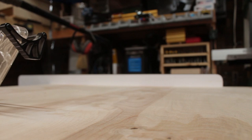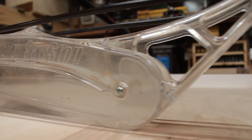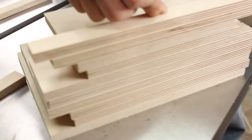One of the biggest challenges was choosing the right material. Three-quarter stock is easy to find, but that's going to look just a bit bulky. Half inch is much better, so I was thinking we resaw some hardwood on the bandsaw. It's a lot of work, and I want to keep this thing simple. Some good quality plywood, some nice even layers. It could look pretty nice on a project like this. It's not a traditional look, but, you know, an electronics valet isn't exactly a traditional project now, is it?